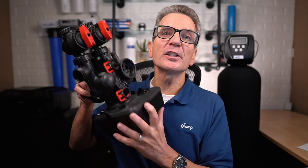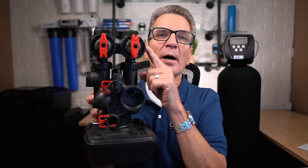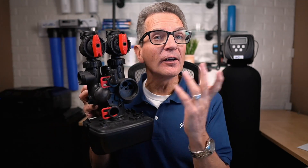How do you know if your system uses the Clack valve? It's pretty simple — just look at the top, not at the face plate, look at the top. What you need to look for is the bypass valve itself. Look for the two red handles. That alone doesn't confirm it's a Clack valve. What you need to look for is that the two red handles on the bypass are pointy at one side and splayed out like a V on the other end — basically they look like an arrow. If they're red and they look like arrows, it's a Clack valve.